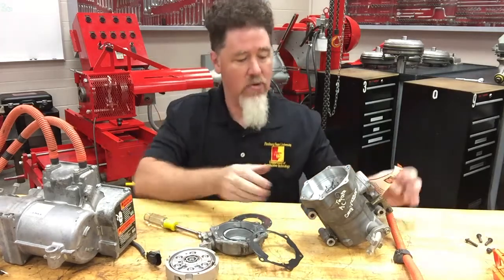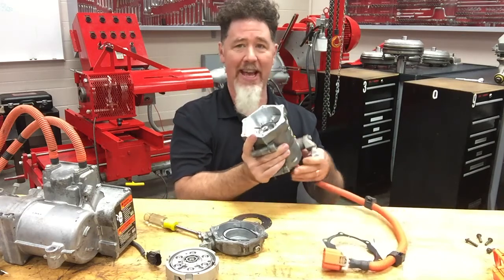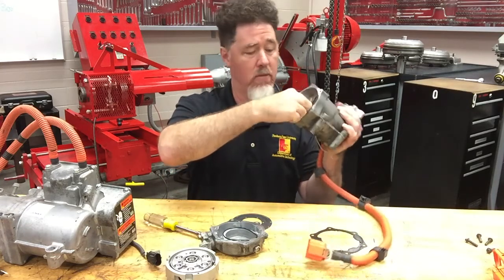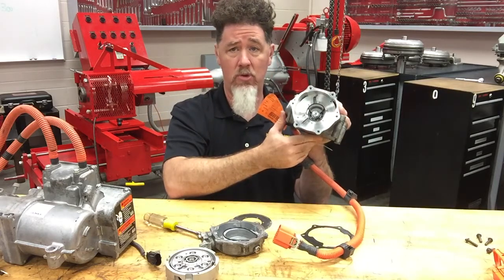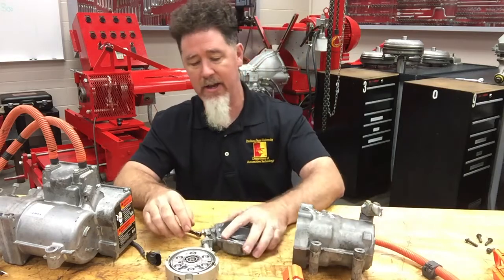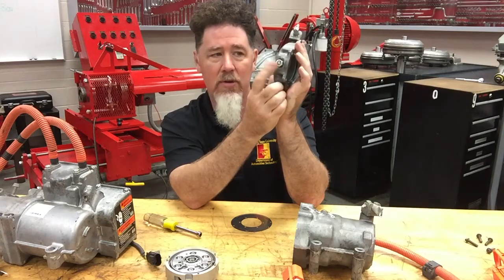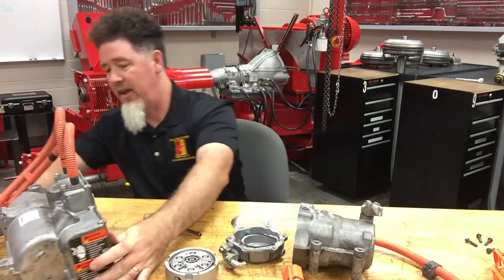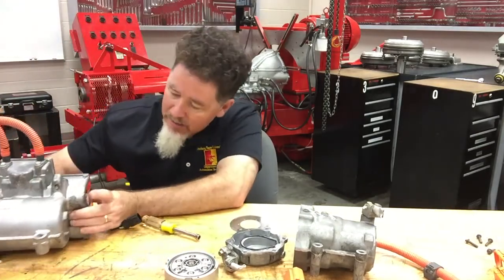When assembled and oscillating, you can see it pushes refrigerant from the outside to the inside. The electric motor — which is not easily accessible — rotates and moves an eccentric cam that oscillates the movable scroll. That's the basic operation of the compressor. There is also a blow-off port on the head: if pressure exceeds 500 pounds, it allows refrigerant to escape as a pressure relief. That's everything notable on this compressor.